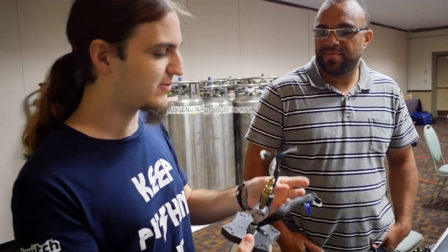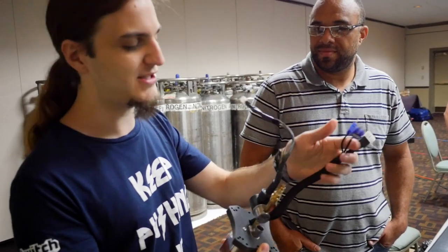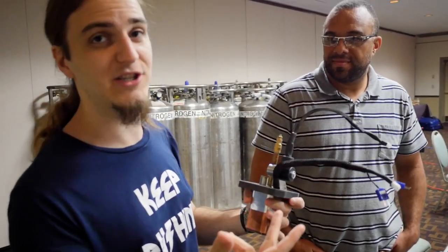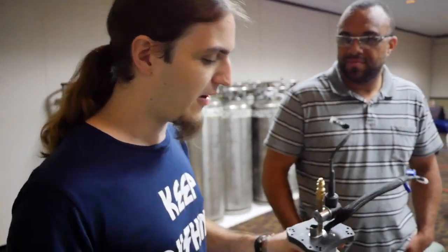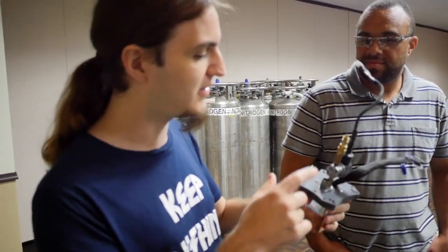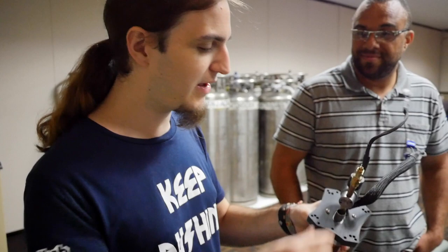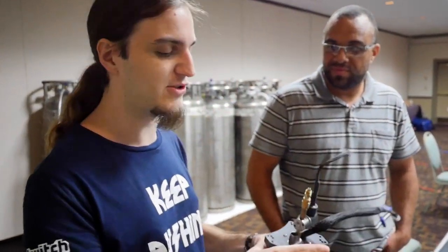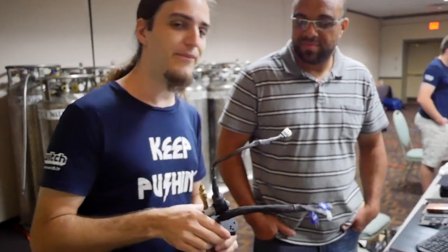It's connected, of course, to power, and in there you also have temperature sensors that help the logic system control the injection of LN2 into the pod. Of course, LN2 expands, so you would have pressure build up at some point. So there's a vent here on the top, and the nitrogen vapors evaporate through here, so there's no risk of explosion.